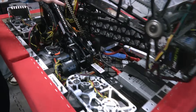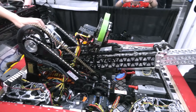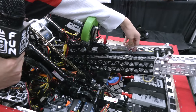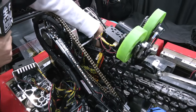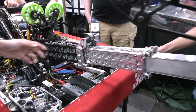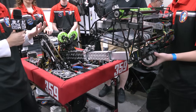Going up to our arm system, we have two motors that run the extension of the arm. It's a three-stage arm with one fixed and two moving stages. The first stage is clamped to the second stage with this belt here, and the belt is run from the chain and comes down — the pulley here extends the belt out. For our second and third stage, we have a rope that ties in for it to extend.